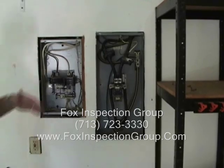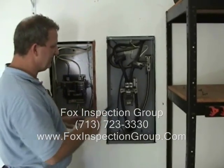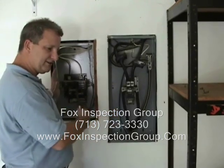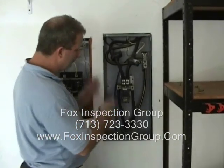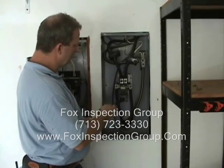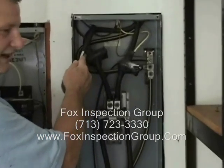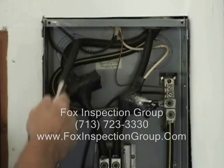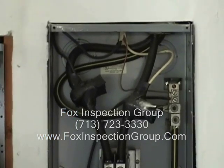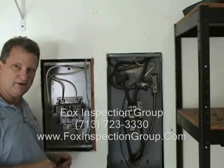This is one of our favorite findings. We see this on occasion when we've got subpanels. On this side we've got a main panel, and here we've got a subpanel — there's going to be another subpanel somewhere in the house. We're looking in the main panel; we've got a 200 amp breaker here, but lo and behold, on the load side of that, we've got a direct connection with 10 gauge wire on a 200 amp circuit with no kind of overcurrent protection. And what we're assuming is that that's in turn feeding this subpanel over here.